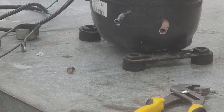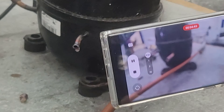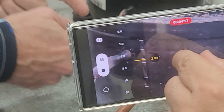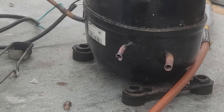That's about as clean as we're going to get the inside of that pipe. You can see that opening — it was totally blocked and now it's clear. All we have to do now is clean it up a little bit. There's a split right there so we need to cut it a little bit more. Take a hacksaw and cut it — don't use a tubing cutter because it can crush. With solder all around it, it's not smooth, so a tubing cutter won't cut cleanly. Use a hacksaw, sand the outside, ream the inside a little bit, and get it ready for brazing.